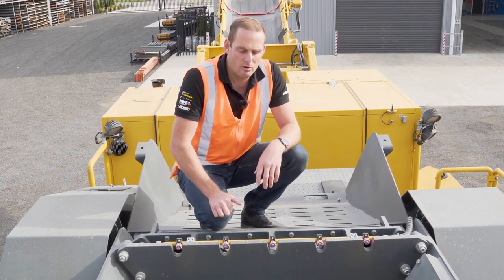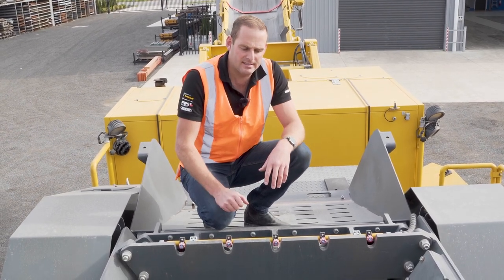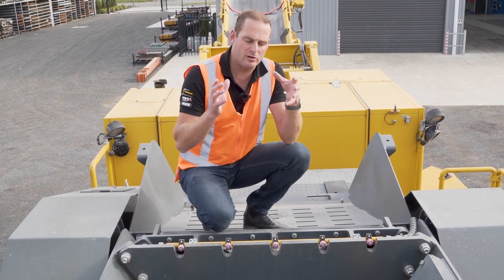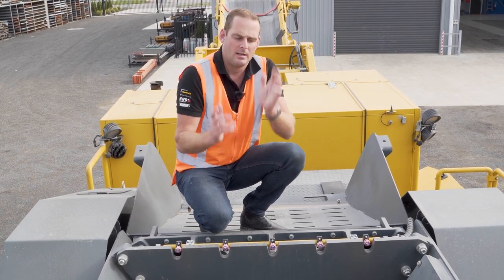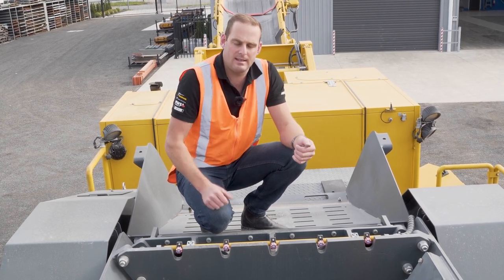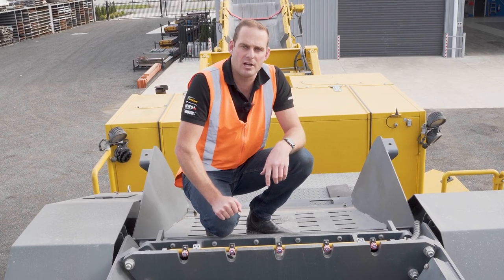In the case of a hard rock application, you might get some rock that's very dense. Sometimes you'll get a big, heavy, hard rock in there that'll open the closed side setting enough to keep the momentum of the jaw going. The non-stop jaw system is a lot more consistent than the traditional wedge style, and overall it gives us better production.